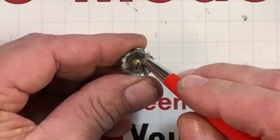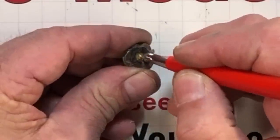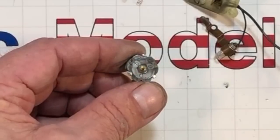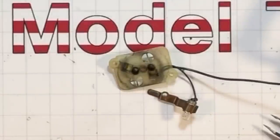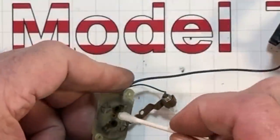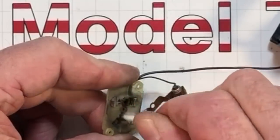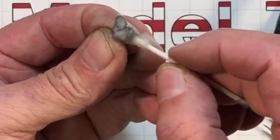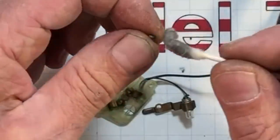You can see these commutators still aren't very clean, and that's where the fiberglass pencil comes in really quite handy — get it shining like that. The brush holders themselves get dirty too and they've got to be cleaned. Take a Q-tip saturated a little more than normal in mineral spirits and get inside these brush holders. That creates problems — creates lack of power flow from resistance. And then the brushes themselves need to be cleaned. That's also another really dangerous part, as far as lobbing them across the room goes.